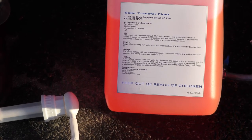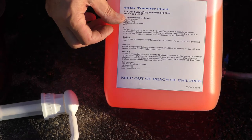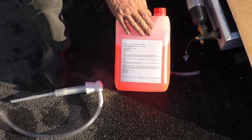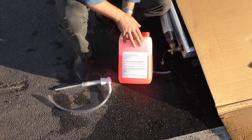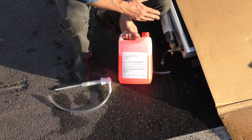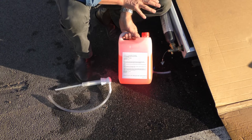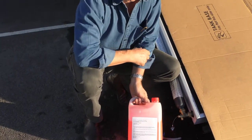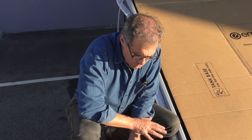The last job now, we're just going to put our heat transfer fluid in, as you can see in this 5 litre red bottle. The contents of this is propylene glycol. You must ensure that you only put into this system the requisite product that we supply. You can't use bars or leaks or anything like that — there's ethylene glycol in those and it's very toxic. Propylene glycol is food grade, used in a wide range of the food industry — baby formula, food, all sorts of things. Very safe. In the concentration levels we put in, and the other products that we put in there with it, these are the only ingredients you can put inside this system. Because in case of any breach between the potable water side and the closed circuit side, we don't want any other substances getting into the water supply system.